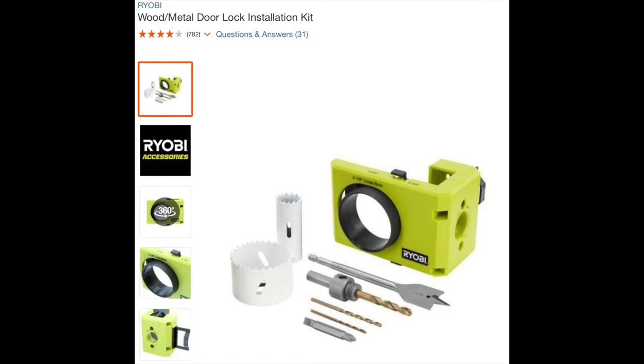The last part of that job was to hook up a VHS player to the TV so the client could watch VHS cassette tapes, and I was somehow able to figure it out. But afterward I couldn't get the cable back on the TV — the daughter said she'd call Spectrum to sort that out. Earlier for the first client, I expanded the doorknob holes that had vintage doorknobs — expanded to two and one-eighth inches — so they could fit brand new doorknobs, using the Ryobi jig I purchased a while ago.